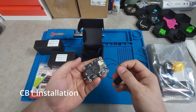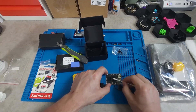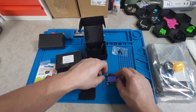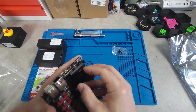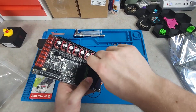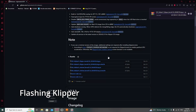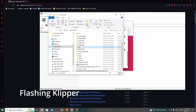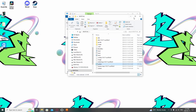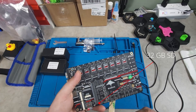The antenna and the heatsink can then be attached to the CB1. The CB1 snaps into place on the M8P and is secured with the four screws included in the package. A jumper to power the board via USB is added right above the CB1. Next, we'll download the CB1 image from the BigTree Tech GitHub and flash it to the 32GB SD card via the Pi Flash tool. Once the image is flashed, we will edit the system file with Notepad to add our wireless network and password. Insert the SD card into the Manta board and power it on via USB.